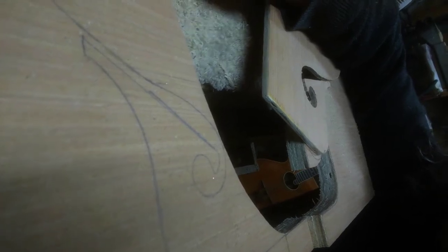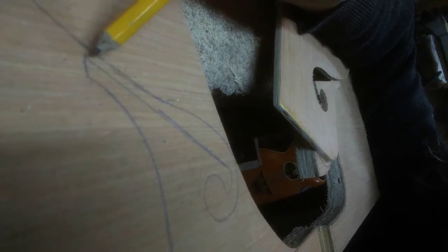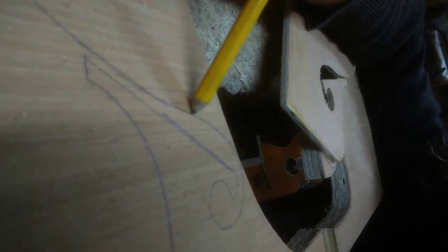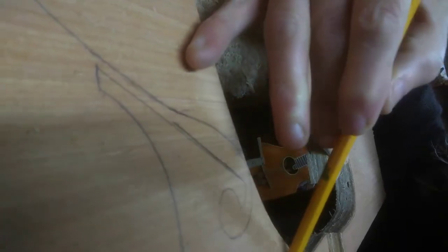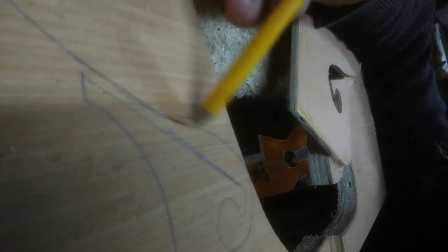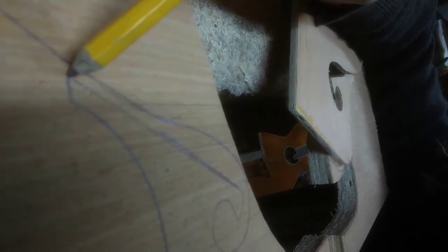But the problem I have is when I'm building the mould here, this actual bit of wood is the only thickness I've got supporting this whole thing, and I'm not sure what my best plan will be. I want to get this curve right for the bent sides, so when I make these blocks, I can temporarily stick this bit of the mould to the blocks and then detach it once the sides are in place. Or I think I will try and cut it out initially and somehow squeeze as much strength out of that little piece as I can, but we'll see how it goes.